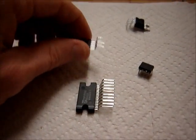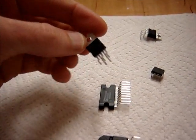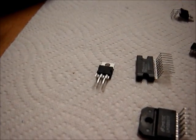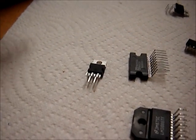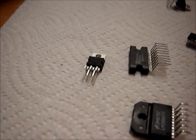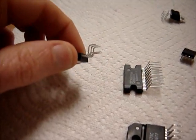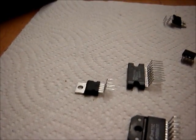Which one is my very favorite? I think I mentioned it already, but I like the TDA2050. It's super simple to use. I like efficient speakers, so I don't need a lot of power to drive them. I used to drive them with a three-watt amplifier and it sounded good, but with very dynamic music I would get into clipping. Moving up to one of these I have more headroom. They sound great and are easy to build.